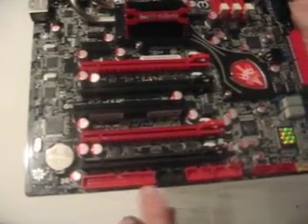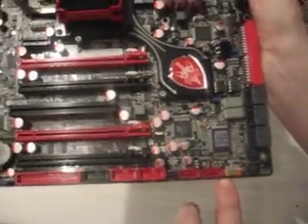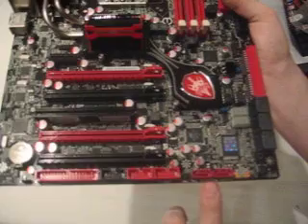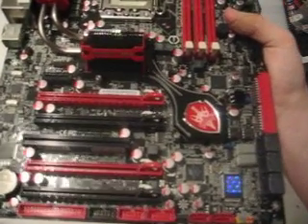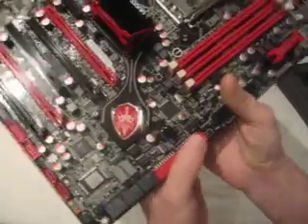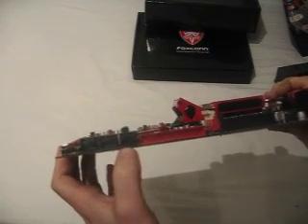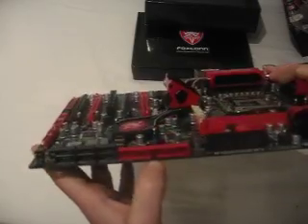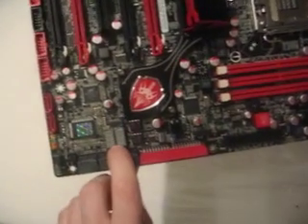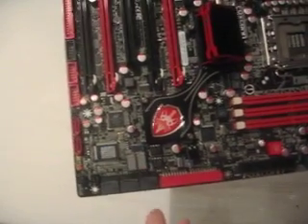Moving around the board: there's a floppy drive connector, FireWire, two USB headers. There are also two SAS ports — a feature of the X58 and ICH-10R chipset — for serial SCSI drives. Quite expensive drives, but great if you have them. Six SATA ports — more than enough. An IDE header is included for those who need it. There are two onboard switches: one for power and one for reset. There's also an LED display to show diagnostic codes if overclocking fails or during boot.